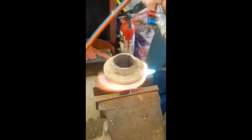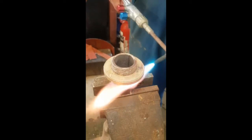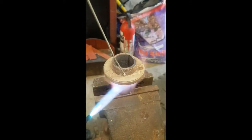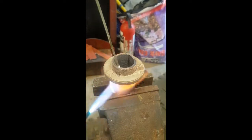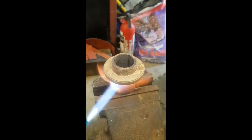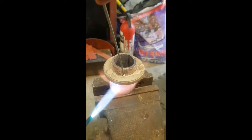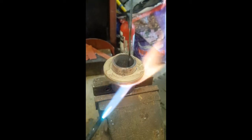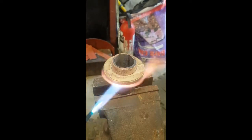It's now time to pull back the flame and start trying the rod. The silver solder I use, which is Easy Flow 55, melts around 660 degrees, so now is the time to start touching the rod on. As you can see, if it doesn't melt I move the rod back and dip it back in the flux powder again. You can really see around this area here where the flux is doing its job keeping off the oxides and cleaning it. You can see where I've not put the flux it's going completely black, which wouldn't take any solder whatsoever.